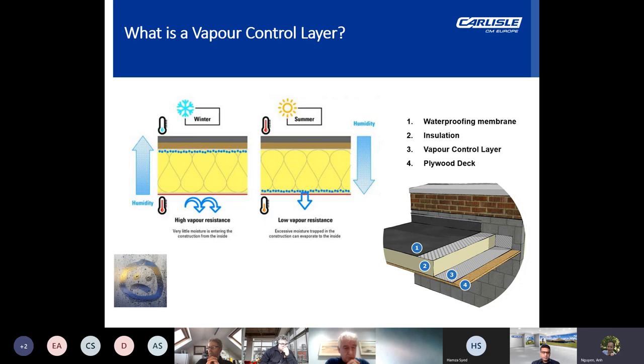Damage from water condensation due to water vapour can wreak havoc on even the sturdiest of built structures and threaten the effectiveness of insulation. Vapour control membranes are frequently used in flat roof constructions to prevent moist air from inside of the building condensing onto the roof assembly and potentially causing damage to materials. These products are an important way to preserve the thermal efficiency of roof insulation and so make up a crucial part of protecting the comfort and energy efficiency of a home or commercial building.